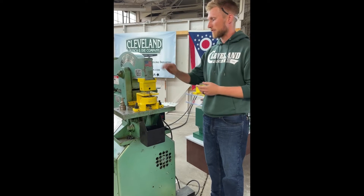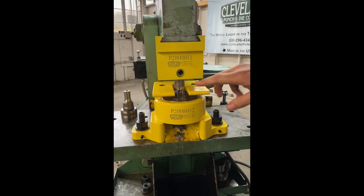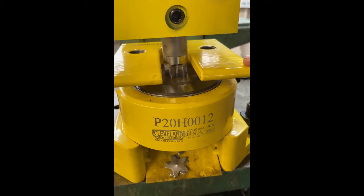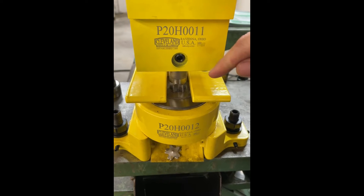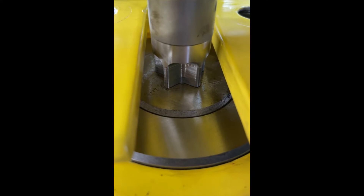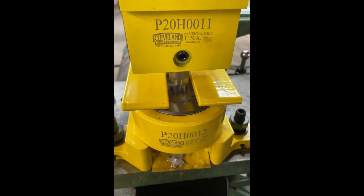Let's look at the machines. The first one is the Piranha P50 with our 28XX attachments. We have a star punch made to punch roughly 93-thousandths thick aluminum. Doing the calculations, the clearance we need is 6-thousandths total — that's 3-thousandths clearance per side. When you're looking at the punch in there, that's 3-thousandths clearance between that punch and die, 6-thousandths total. Make sure all the tooling is set in tight, and that the clearance is even all the way around the punch and die so you get a nice clean hole.